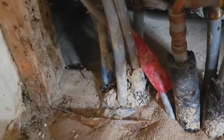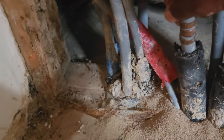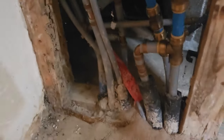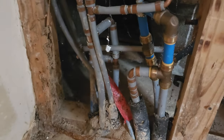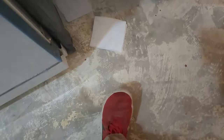We're going to find out which line it is. This is your hot water — you can feel it, most times that's hot — and this is your cold side. So it's mainly possibly this line coming up on the cold water side. We're gonna cap that off and see if we can stop the leak, and possibly cut it here first. Thinking the leak is possibly under the floor right about here, somewhere under the floor in this area.